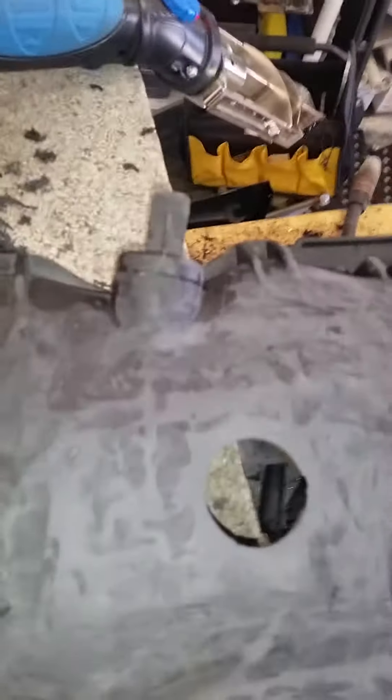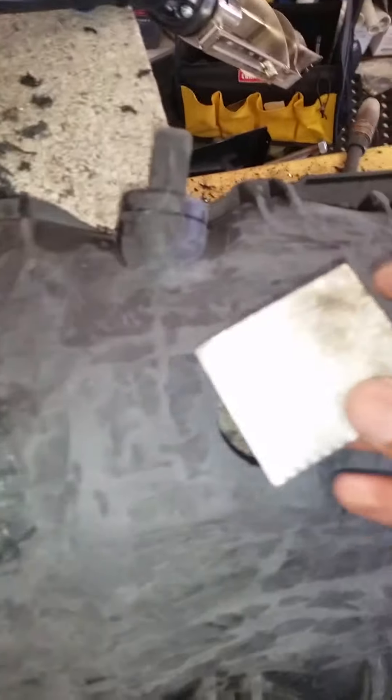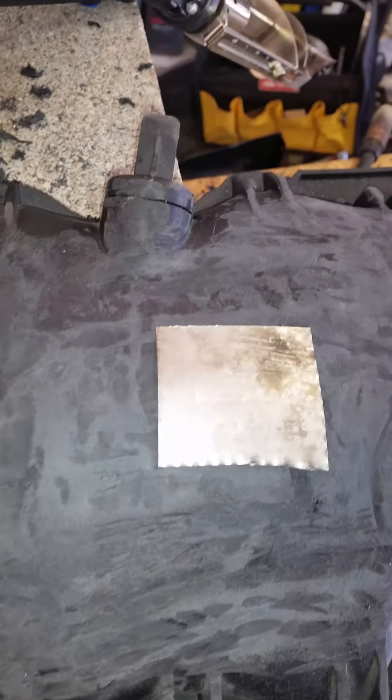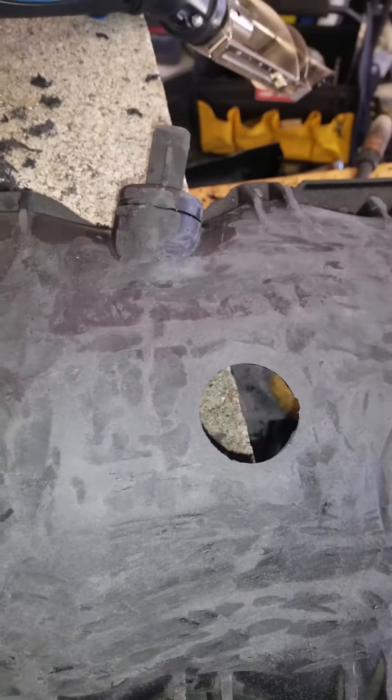However, you could put a steel plate on this side — relatively thin gauge, something like 18 gauge — and drill a hole through one side, then put another steel plate on the outside, drill a hole, and then tack weld it in place so it doesn't drop in or get sucked in, and so it won't blow the top out if you're worried about being boosted.